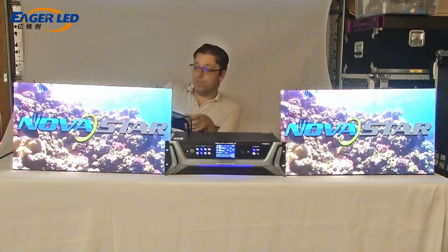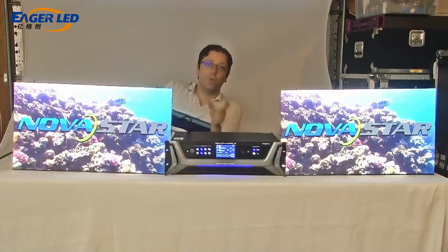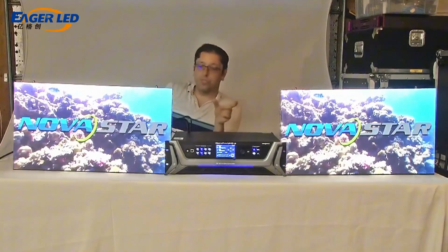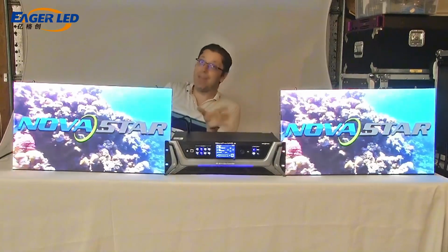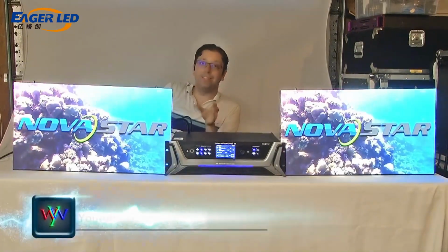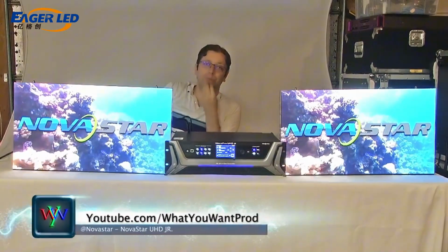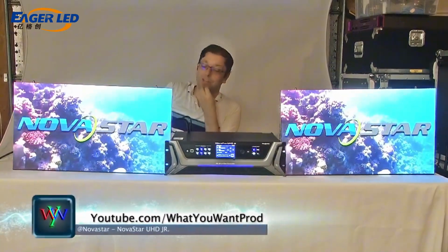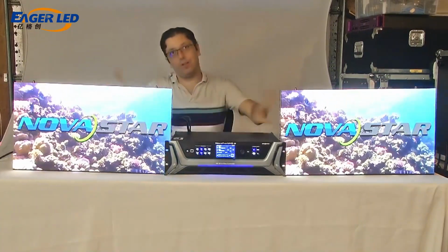The problem that we've been having, especially for the large scale ones, is delay. With the capture cards and with some of the switchers that we've worked with, it adds easily 2 to 10 frames of delay. And that, when you're doing a live event, can be really negative from the standpoint of your live events and your singers and your promoter. So with this unit, that gets rid of all of that.